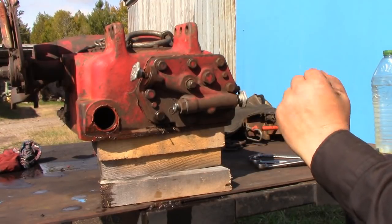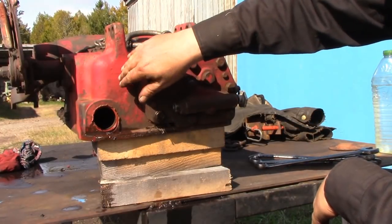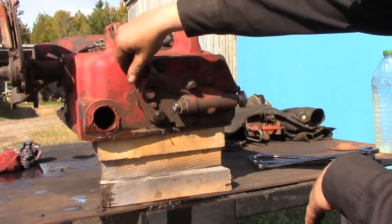If you have this kind of system for running a wood splitter or what have you, it's always a good idea to shut your tractor off before you disconnect your wood splitter from the hydraulic system, because you can split your hydraulic pump wide open — it deadheads the pump and that sudden wall of pressure can split it wide open. So when you're done using the system, shut your tractor off, get everything unhooked, make sure you open this valve again before you start the tractor up and you won't have any problem.